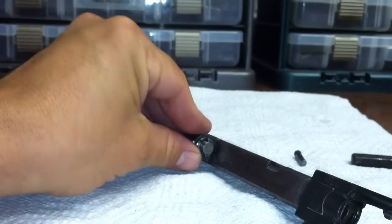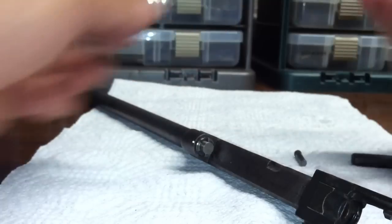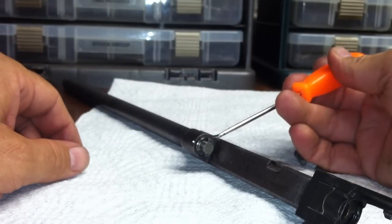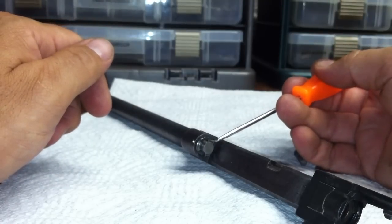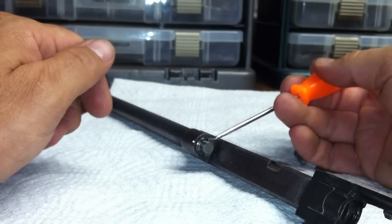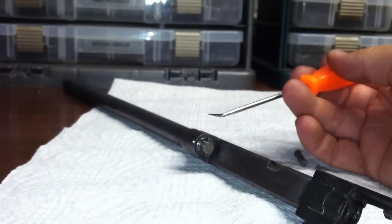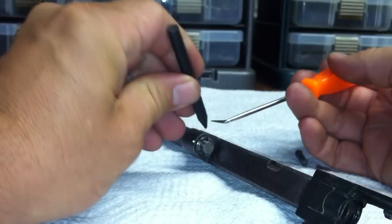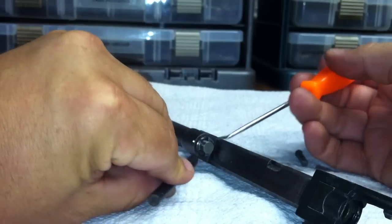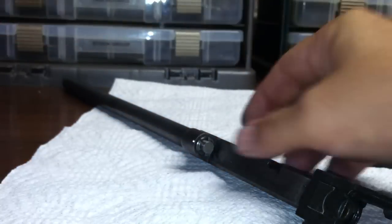Remove the tool and inspect again — make sure nothing cracked. What we're looking for is that this area is flush with the metal on the barrel. This is a Winchester barrel, so it's not a swaged-on cylinder. There's a little detent on the piston nut and you're going to need to peen this area with a special staking tool to keep it from backing out — on this side and on the bottom side. Once it's staked in, you should have it inspected by an armorer.